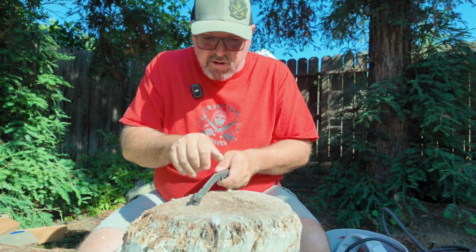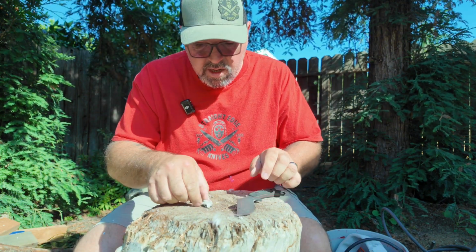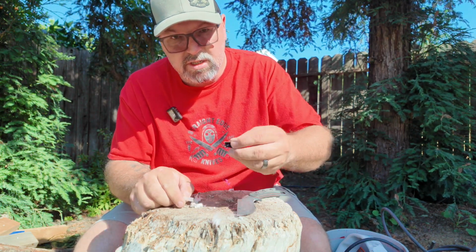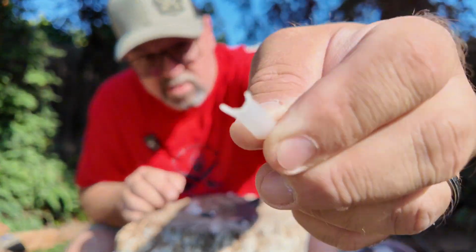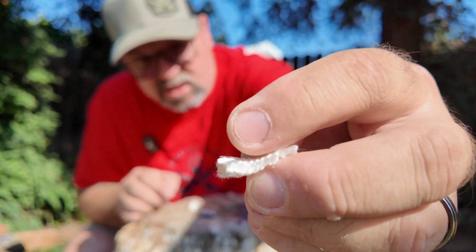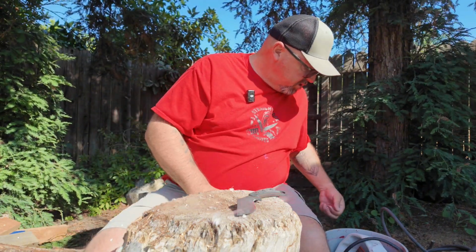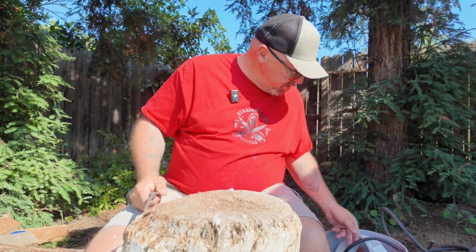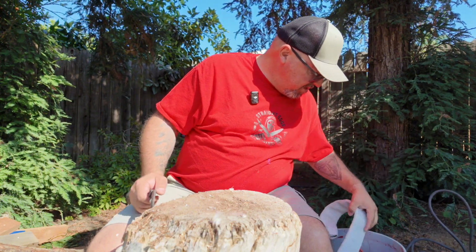Press cut is a little bit harder to do on pressure washer hose, because the reason why I was cutting this in half is I wanted you guys to see. There's actually 3 parts to this. You have an outer sleeve, you have this hard nylon inner sleeve, and then you have this kind of cut abrasion resistant inner nylon part. So definitely makes it a little bit harder to press cut down through, but that's why I wanted to do it. I want to get down there, get that pressure on there. But yeah, if you had to come in and cut some of that stuff up, you definitely can.